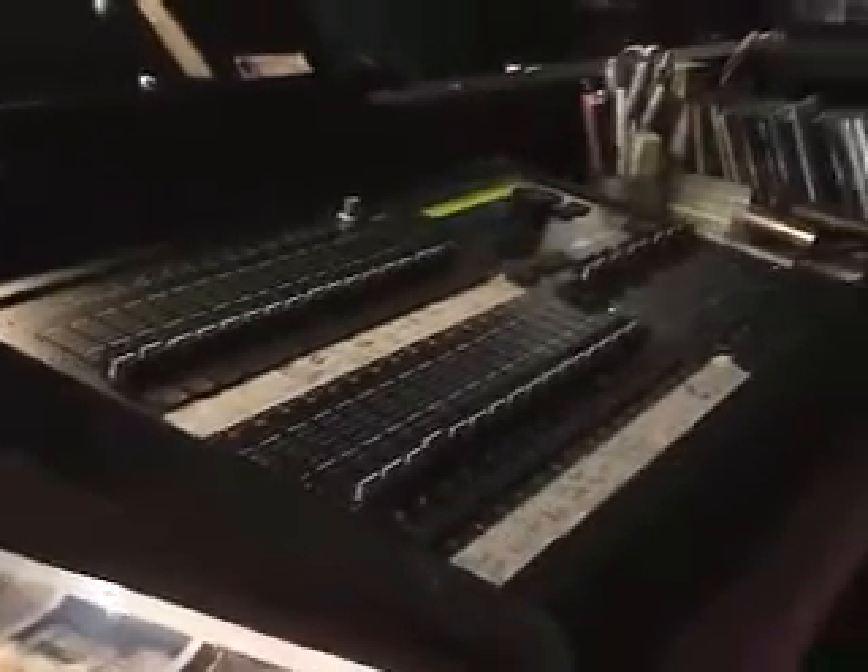But let's say you want to turn the stage lights on — that gets a little more complicated. To turn on the stage lights, we've got to go back to the lighting booth. The first thing to do is turn on the power strip underneath the lighting table. The red light should come on. This will send power to the lighting control board as well as the sound equipment. The next thing to do is turn on the two scary circuit breakers on the rear wall of the lighting booth — one, two. Doesn't matter what order you turn them on. This sends power to the dimmer packs, which are controlled by the lighting board and send power to the lighting instruments above.